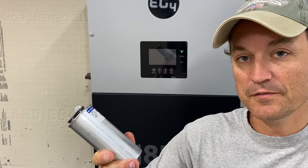Capacitors serve different purposes. In HVAC units, they help make up that extra voltage to get your compressor started. In inverters, they regulate voltage and do all kinds of different stuff, so we definitely don't want to blow them out. People say 'blow your capacitors' and they will actually blow out — but not all the time. Sometimes they'll just fry. It's not always a dramatic pop, but either way you can have problems.